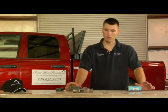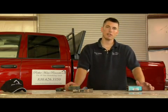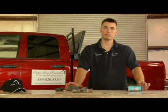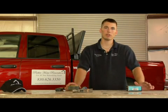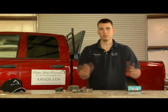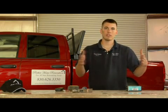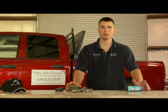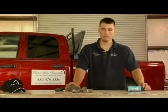The second thing to know is most studs are either 2x4s or 2x6s. And they're generally placed 16 to 24 inches apart from each other. However, when you get into the corners or near doors, they may be slightly different just to make up for where the door had to be or where they drew the door to be.